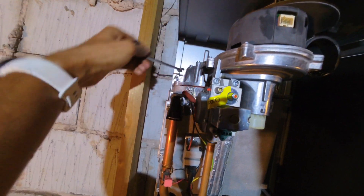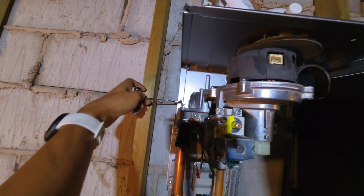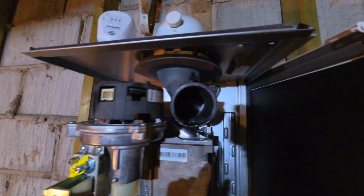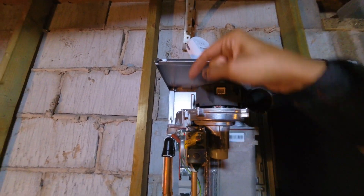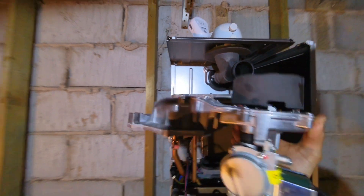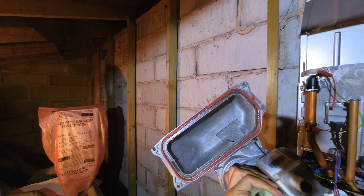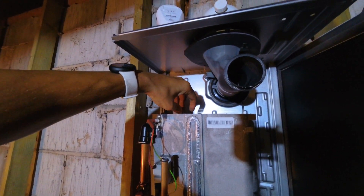I can get it loose enough with a socket and ratchet and then undo it by hand. It's important to note that the two nuts at the back are captive — there are studs on there. When you take the burner out you've got open-ended slits which go into there, but the front two are the actual nuts with thread. There it comes out like that. That is exactly the same as an Ecofit Pure. The burner seal looks like it's been a bit pinched but that would have been like that from the factory. You get two seals — a graphite seal and a red neoprene seal — and both need replacing.